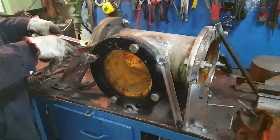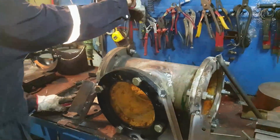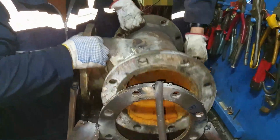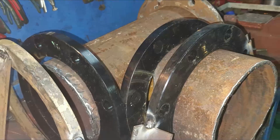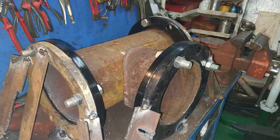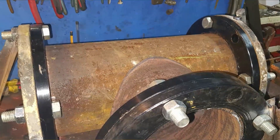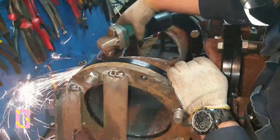After support welding, you can now release the bolts and nuts holding the flanges. Remove the pipe from the pattern. Insert the new pipe and new flanges to the pattern. Re-tighten the flanges with bolts, making sure that the flanges are tight to avoid problems in installation. Grind the edges of the cut for a smooth finish.